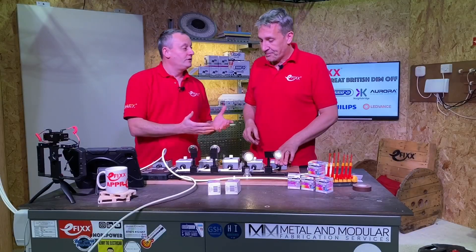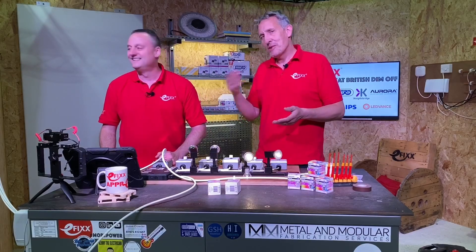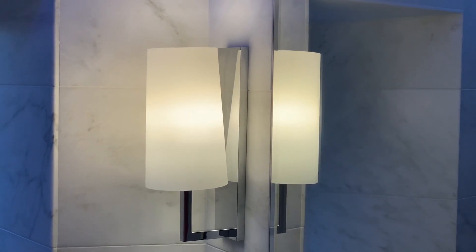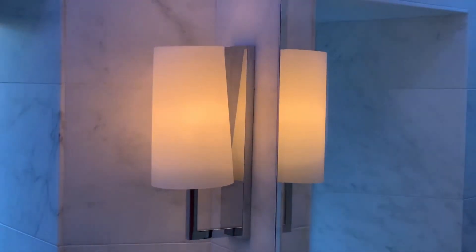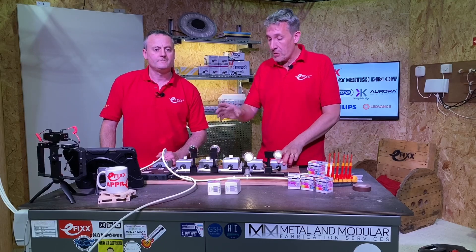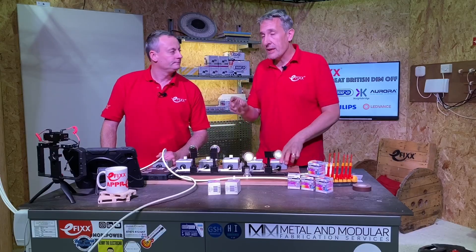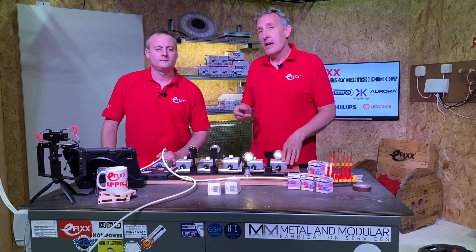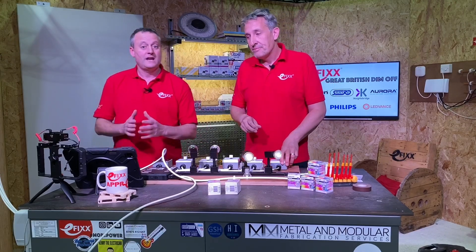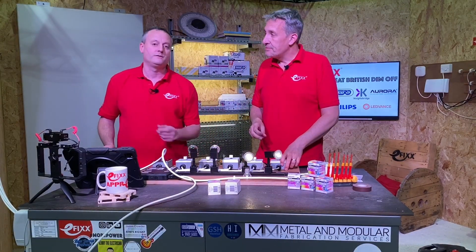What's the benefit to the electrician from using this style of lamp? You can impress your clients and create a nice romantic atmosphere. If someone wants it in a living room or kitchen used for lots of different functions — dimming at night to reduce the light level and change the colour temperature — it's a great solution. It's available in lots of different lamp formats: this is the GU10, but you can get it in regular A-class incandescent lamps, candle lamps, and even filament-style lamps. It can change the mood of the room by simply selecting the correct lamp type and the correct dimmer.